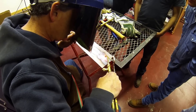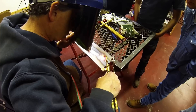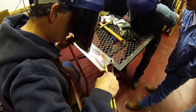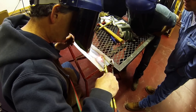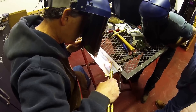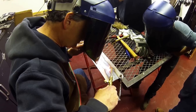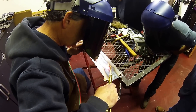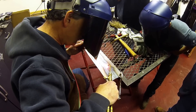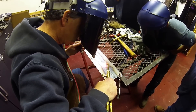This goes to show you a butt joint that requires a little bit more effort compared to when you do a tip edge. When bottom edge meets bottom edge, both leading edges are already exposed — you'd be twice as far along right now because you don't have to worry as much about penetration.